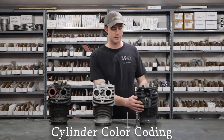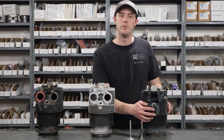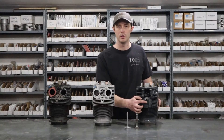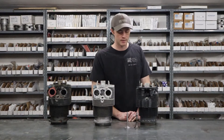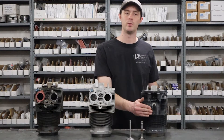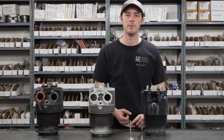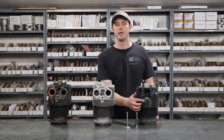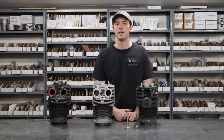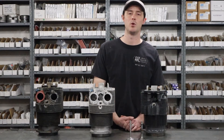One other thing you'll see on cylinders is different color coding on the cylinder fins. This one has no color, it's just the cylinder paint. But the most common things you're going to see are blue, green, or orange. Blue paint means it's a nitrided steel bore, usually from the Lycoming factory. Unpainted or blue both mean it's a steel standard bore — that's probably the most common thing you'll see. If you see orange on the cylinder fins, that means the steel has worn out and it has been replated with chrome. If you have green on the cylinder fins, that typically means the cylinder has been bored oversized.